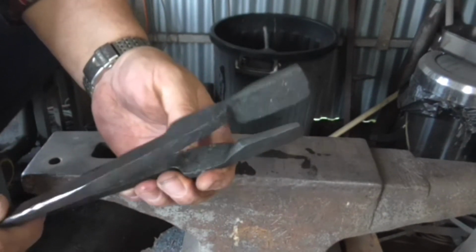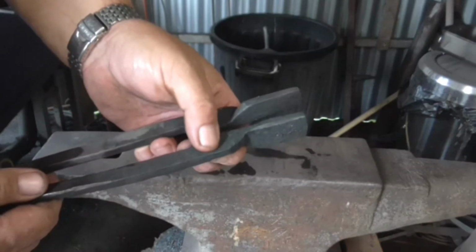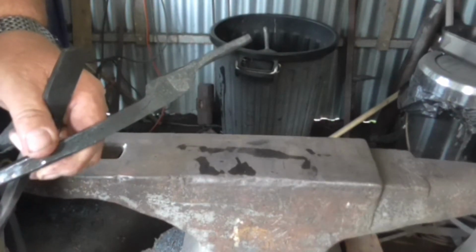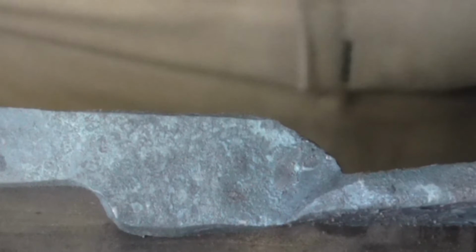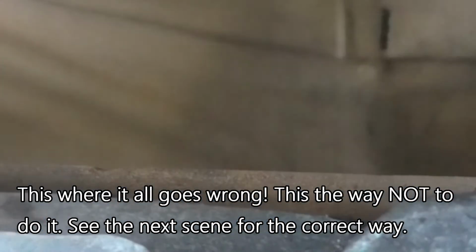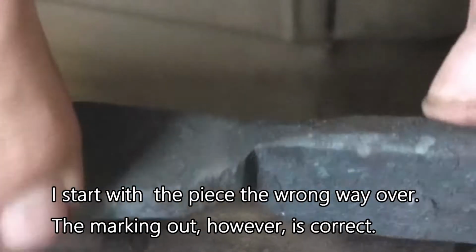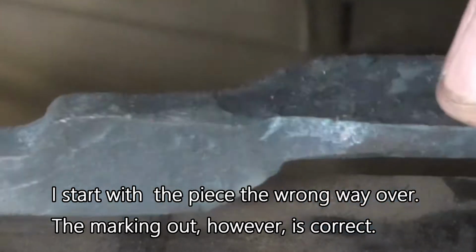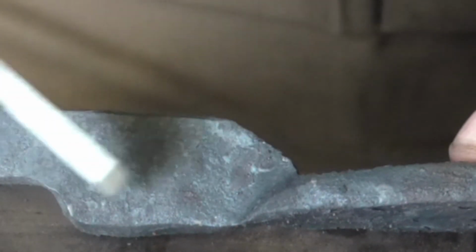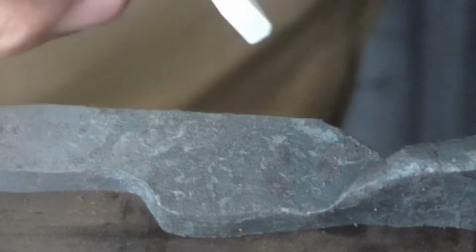Now, next thing to do is to punch the rivet holes. Now, the thing to do here is choose the smallest hinge plate to punch first. Marking out for the punched rivet hole. This is the hinge plate. I've got it this way over because punching it this way will stop the problem if I try and punch it that way to start with. So flat side first. Now this is basically a 4-sided figure. Imagine it's a square. Now the idea is to draw across from the corners.